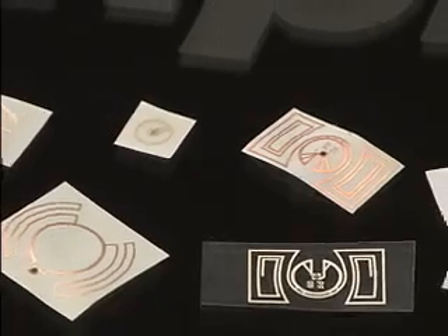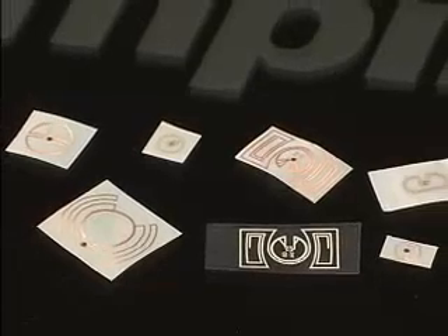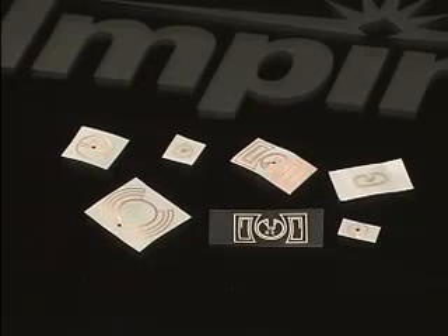So what's different? Just two things: the reader antenna and the tag antenna. We've designed a whole suite of low-cost UHF Gen2 RFID tags optimized for DVDs, garments, pharmaceuticals, an entire range of items, even those containing liquids and metals. We've attached a simple, low-cost near-field antenna to Impinj's Speedway reader. And that's it — no change to the reader, no change to the protocol. It's UHF Gen2 all the way. But as they say, seeing is believing, so let's see it in action.